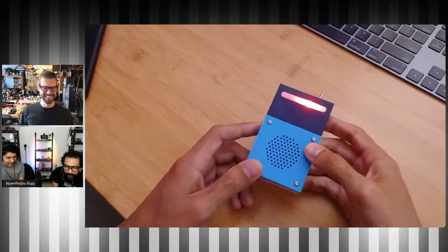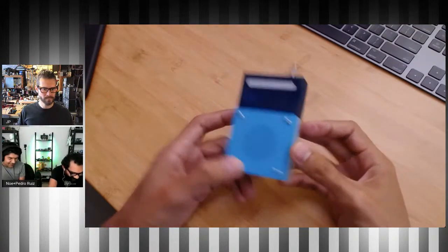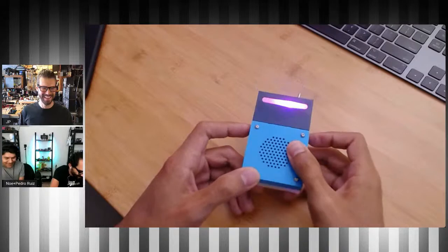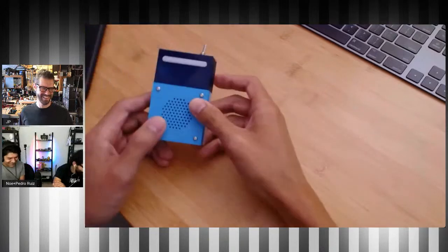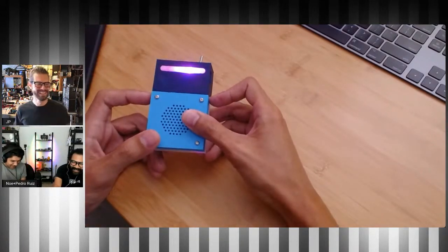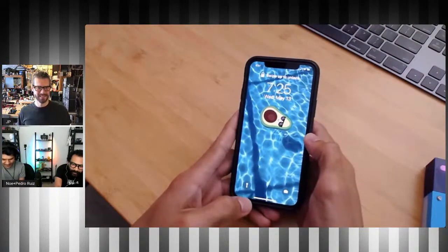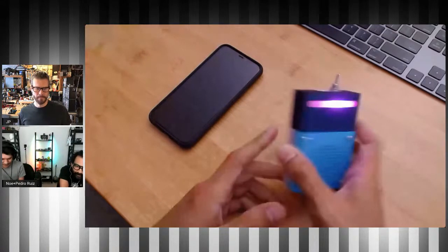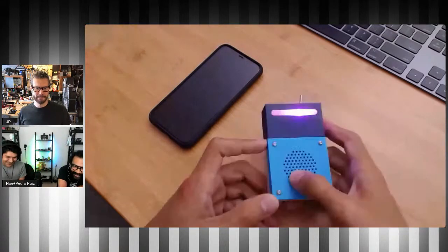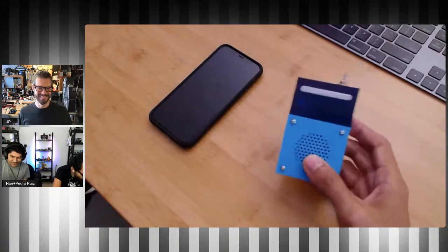So this week's project is also a BLE project. It's using the Feather Sense and the app. There it goes. It's snoring at us. It's hissing. It's paired to my iOS device, and it lets me know when I get a notification. Where did that notification go? I don't know where it went. Let me send a new one. So you pair to your iOS device and it will trigger the mini vibration motor, and it uses the haptic motor driver so you can choose different effects and things.